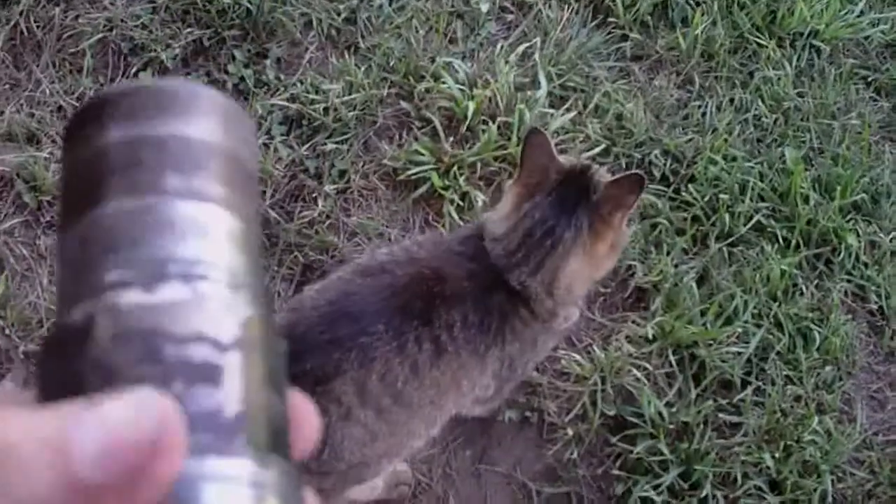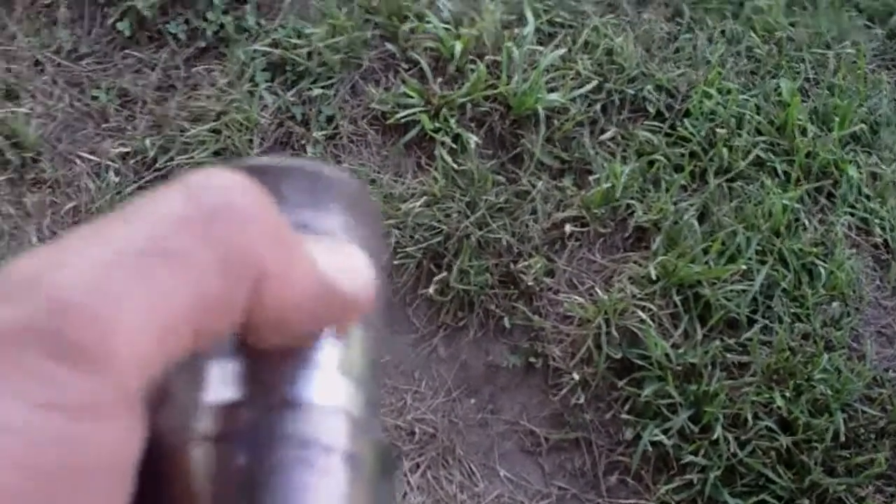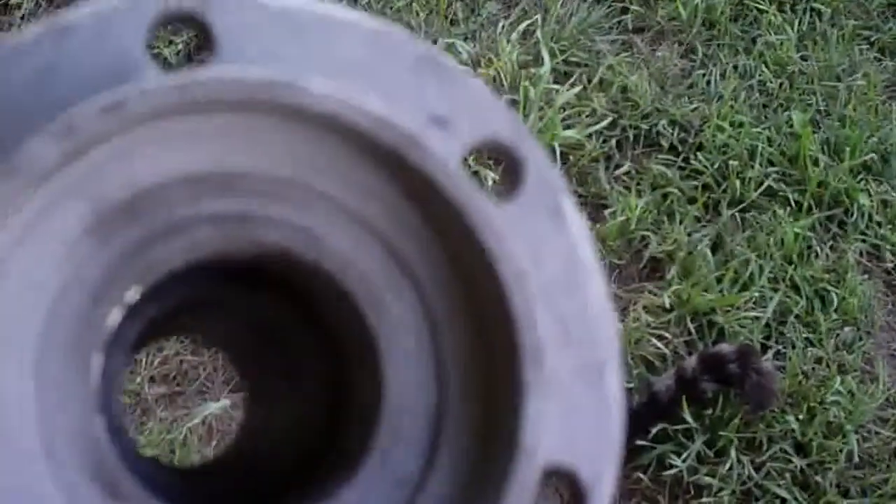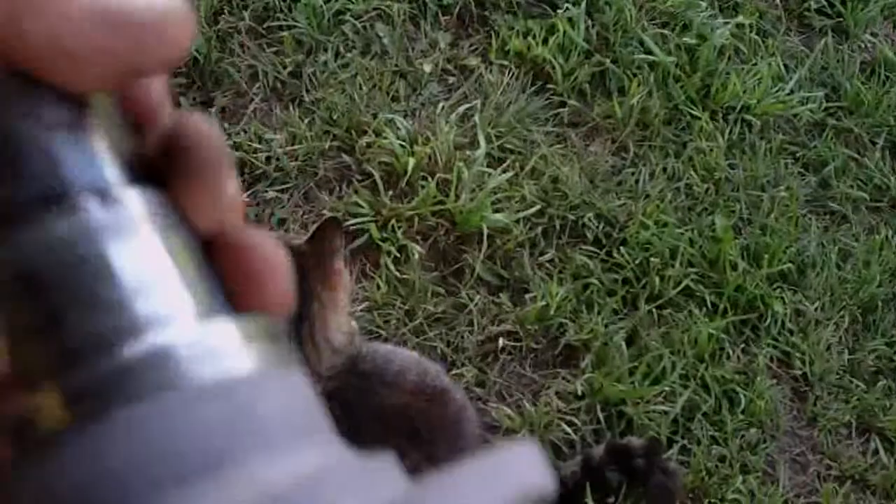This rotor is showing some signs of distress. First, there's some blueing on it, which is not good. Second, it's dinged up - like somebody was beating on it with a hammer. You can see what's almost like pronounced rust marks, and they also smashed the threads a bit. You can see a crosshatch pattern and slightly mashed threads where someone obviously clamped this in a vise at some point. Internally it's fine, but somebody beat the hell out of it on the outside - this one's going to be a little more work.